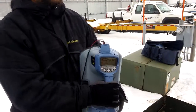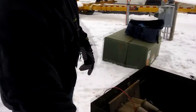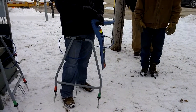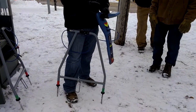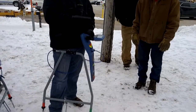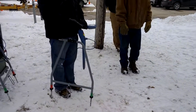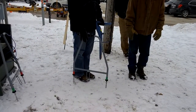Our ground rod's good — it's making noise, letting me know it's completing a circuit, and we can go ahead and use our A-frame now. When you plug the A-frame in, it will set itself up automatically, so you don't have to worry about what mode you're in. Just get it plugged in correctly; you'll hear it beep, see the arrows show up on screen, and you're already picking up decibel readings. You don't have to be directly over the wire — you can be off to the side 2, 3, 4, 5 feet.